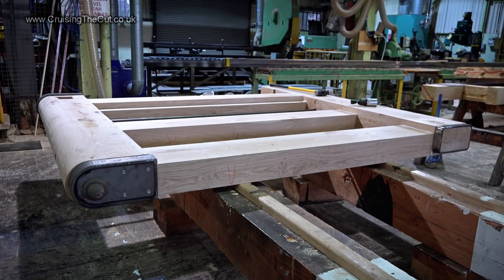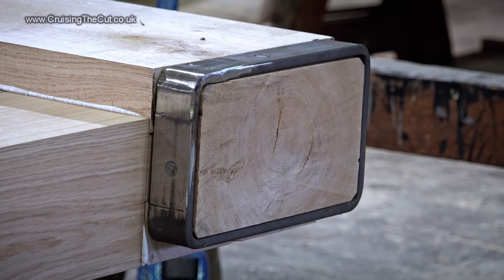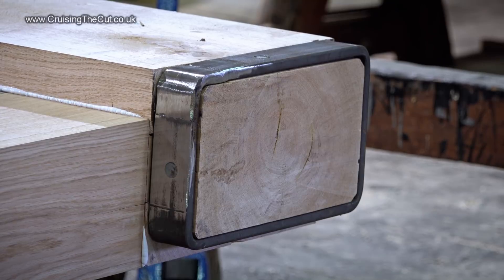Here's one that's starting to look a little more like a lock gate as we know it — notice the huge beams lying lengthways and the metalwork strapped around the bottom to hold it in shape. We have different things for strength, especially because the oak tends to split. We put metal straps around the outside of the timber to hold it all together, and there are some protective things to stop the boat damaging the lock gate. Things that can be refitted if damaged and replaced. A lot of that is done before the gate is actually assembled, and after assembling we start fitting things like the boards on one side of the gate and any safety metal fendering.